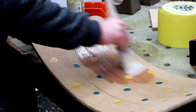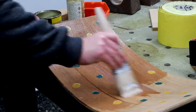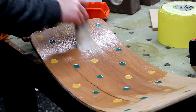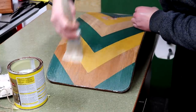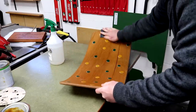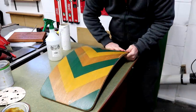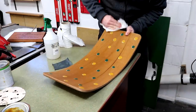After a couple of hours, once the paint was dry, I added a few coats of water based varnish, applying it in the direction of the grain and being careful to wipe away any drips at the edges. In between coats, once dry, I de-nibbed by spraying on a little water and then sanding with 400 grit before wiping away and applying the next coat. It got three coats in total.